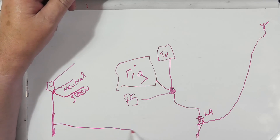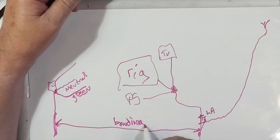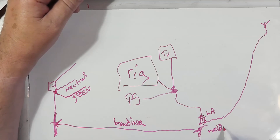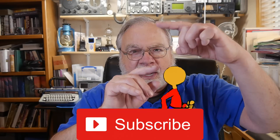These two need to be connected. That's called bonding. Again, compression fit, compression fit, or welded. You can get little thermite devices that you put around the ground rod, put your wire in, light it on fire and it will burn and eventually give you a copper weld — copper to copper welded with copper between them. Be sure that you don't do these right next to the house, especially next to anything that can burn, because they'll shoot flames and you can set your house on fire doing that.